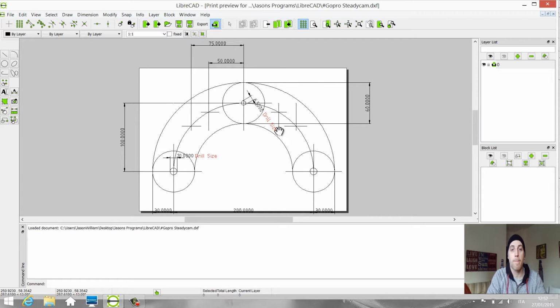Okay, to make things even easier, I'll be printing this out on printing paper with a sticky back. So basically I'll be cutting out my project, which I'll show you later on, and actually sticking it onto the piece of Perspex I found, which is about 6 millimeters thick, about the right size for our project. So basically I'll print it out at full size, cut it out, and stick it onto the piece of Perspex. So there won't be any need to take any measurements or anything. Basically we'll be cutting out our design and drilling the holes directly through the design we've printed out.